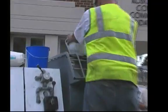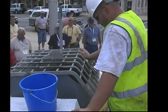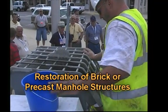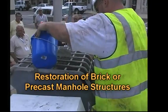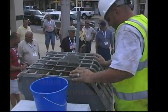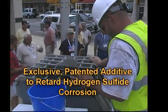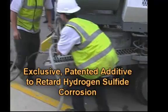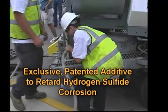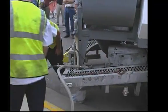This one we're doing is not really too bad, but we wanted to enjoy the process and we had to keep it in the same block. Normally the ones we do are in pretty bad shape. Brick structures, precast structures — and also for hydrogen sulfide, to keep your manholes up, we have an additive that puts that in. We're the only company that has that additive; we have a patent on it that retards hydrogen sulfide from these manholes.